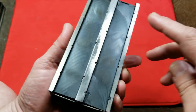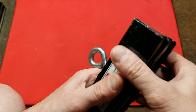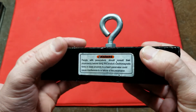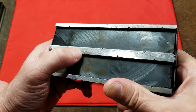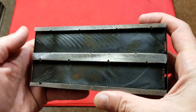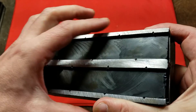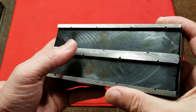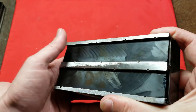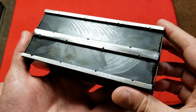It is laminated steel, so what they do is they take the magnets, glue the steel panels on, and then tack weld these steel sheet metal pieces to hold it together. I finally learned what these little notches are for — these things are for lifting and shop use, so they get dropped, it can break the glue, and the notches prevent the magnets from sliding out and getting stuck to the material itself.